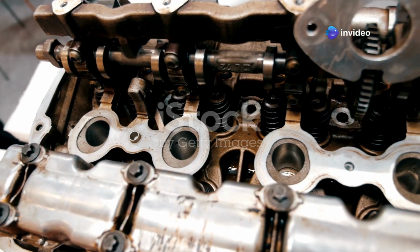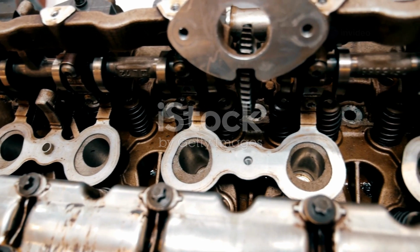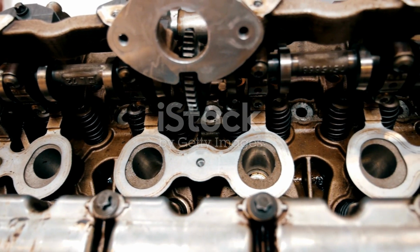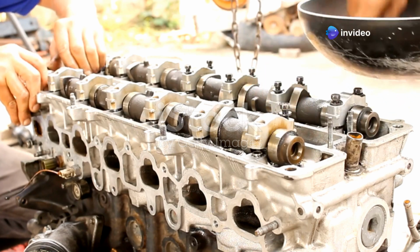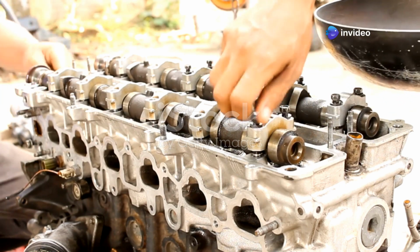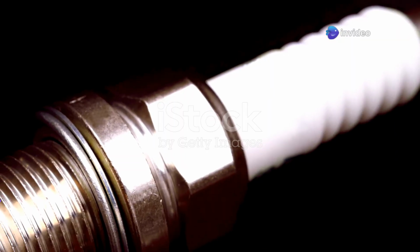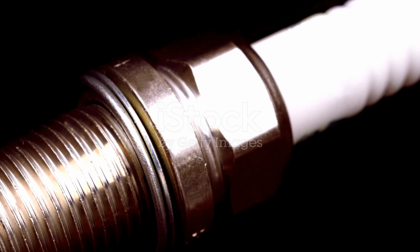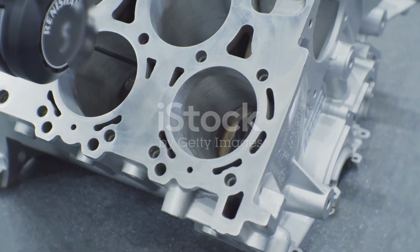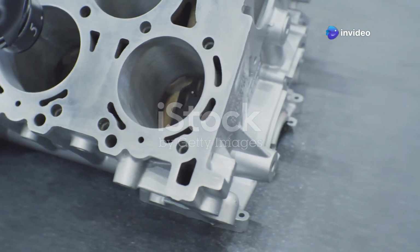The intake and exhaust valve ports are located in the cylinder head, along with the spark plugs and the intake and exhaust valve actuating mechanisms. After the cylinder head is cast, the spark plug bushings, valve guides, rocker arm bushings, and valve seats are installed in the cylinder head. Spark plug openings may be fitted with bronze or steel bushings that are shrunk and screwed into the openings. Stainless steel helicoil spark plug inserts are used in many engines currently manufactured.